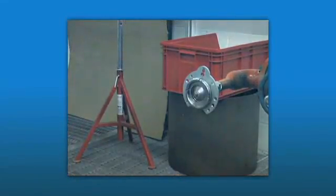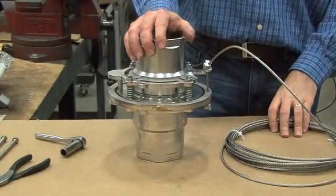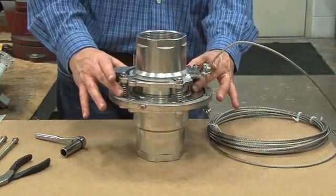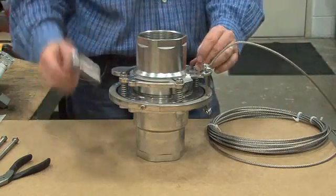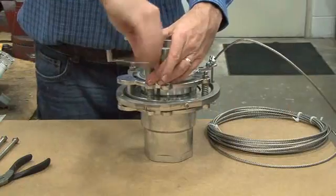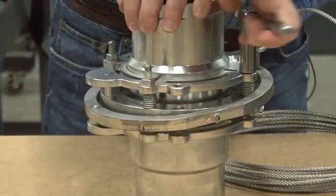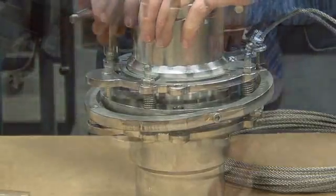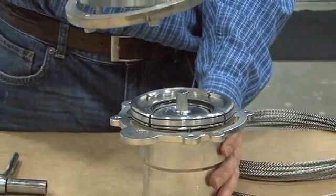To maintain the unit, or to put it back in service, the first thing you will need to do is pull this slide ring all the way back. This is done with a socket wrench. As we tighten each assembly bolt, we are lifting the ring. Evenly tighten the screws all the way around until they are bottomed out. This will allow you to separate the unit.